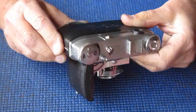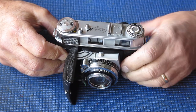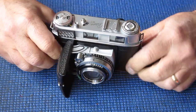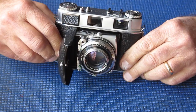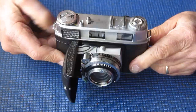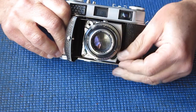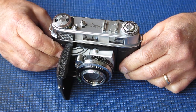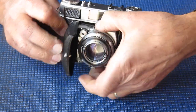It's all back together again now and everything's working nicely. The exposure meter is not a hundred percent — the selenium cell has obviously lost some sensitivity and doesn't respond accurately across the whole range. But that is unfortunately extremely normal with 60-year-old selenium cells. Apart from that, the camera is working nicely: cocks and fires nice and smooth, film advance, rangefinder nice and clean and accurate, focus is smooth — everything's good. This camera is good to go and it can join the growing stack of cameras here that will go home once the post office is open again. Thanks for watching.